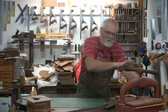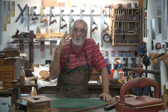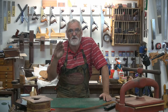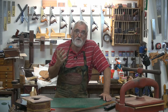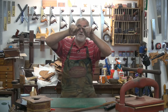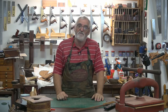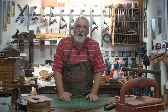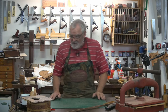and tomorrow where that glue was is going to be set, and the newspaper is going to be hard on there. That means that when I go to router it, the newspaper is going to be crisp. It's going to be taken away as if it was just a piece of timber, and then I've got a glue joint with paper all the way around that I can then spray the enamel on and do the flocking. When the flocking's dry, I rip the paper off, dampen that newspaper, and it'll peel off, or just sand it off. So that's what we'll do.